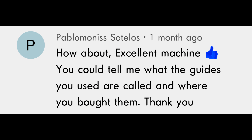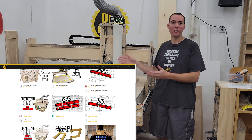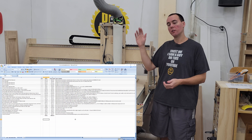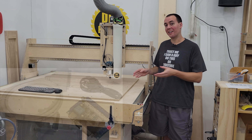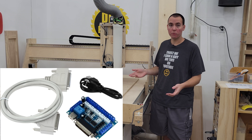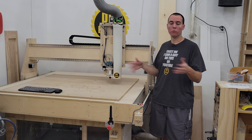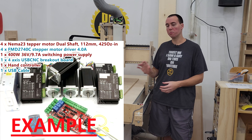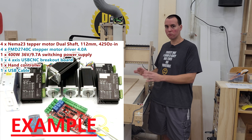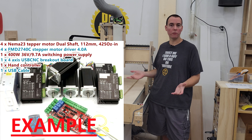For the guides question: all materials can be found on the cost breakdown spreadsheet available for free download on my website — go to Plans, then Shop Project Plans, and scroll down. On interfacing with Windows 10 with no parallel port: because my control board used a parallel port, I grabbed an old Windows XP computer from my dad's basement. If you're going to use Windows 10, you need to buy a controller board that works with it. A parallel-to-USB converter doesn't work for these old parallel port boards — you'll need a board that uses a USB interface from the get-go.